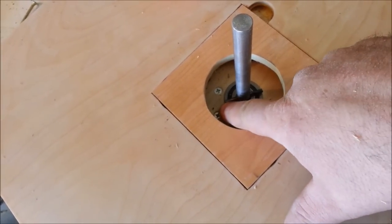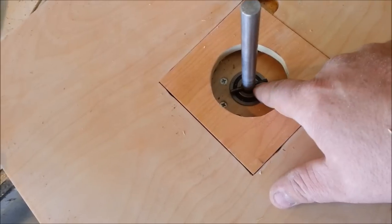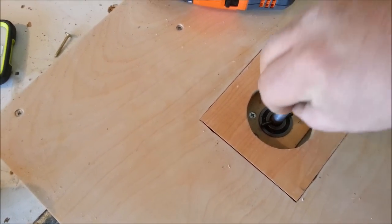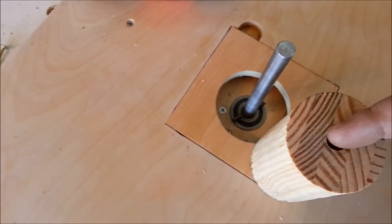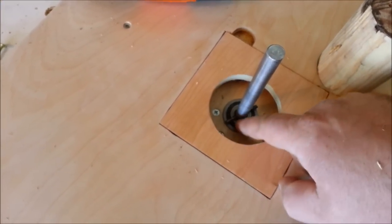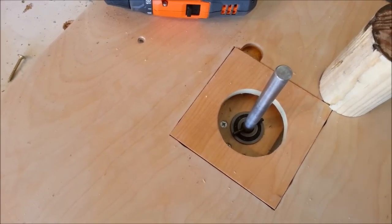I have just a piece of a drill bit — I actually cut this through-hole with this drill bit and then cut it off. Now I'm going to slide my sleeve over the top of that, but first I want to cut a little groove out of the top on both sides so when I sleeve it over the top it sits over that bar, which will keep it from spinning freely on the shaft.